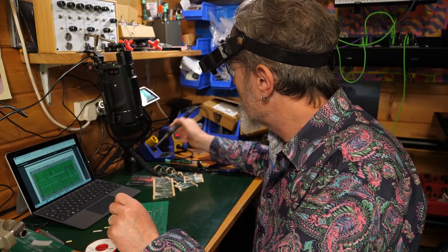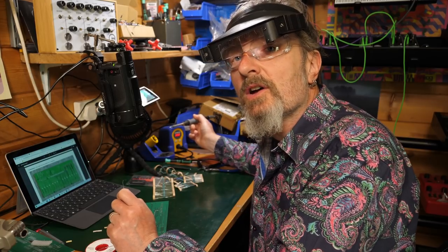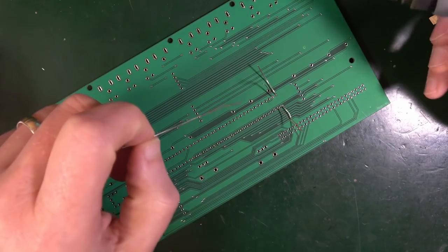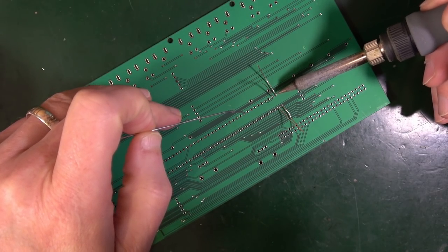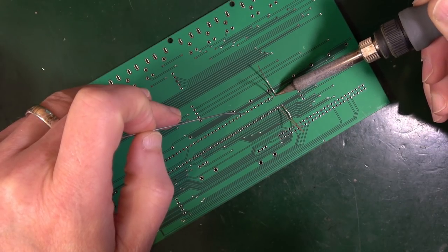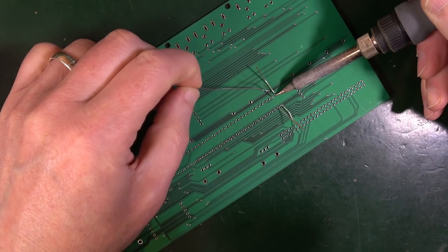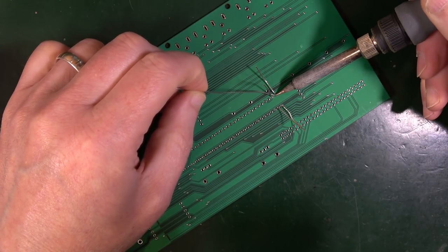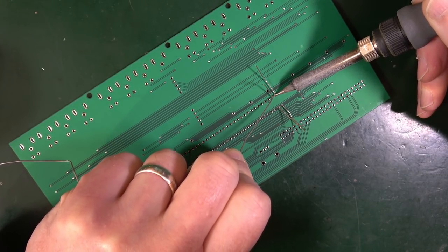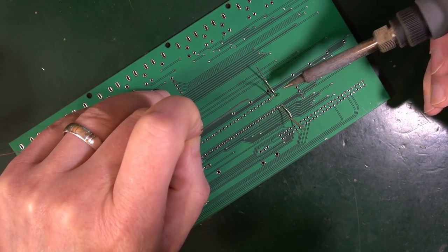So I use this wire wool to clean the end of my soldering iron. I also use a little bit of wet sponge. A combination of those two things seems to work. There's probably a reason for each. I can't quite remember. Anyway, what you want is your soldering iron to heat up both the ring and the leg. Now you find the very tip of the soldering iron isn't always necessarily the hottest place, but you have to get it in there wherever you can, where you're making best connection with everything. Then present your solder to it, and with a bit of luck, it will just melt gloriously. It may not, in which case you might need to angle it slightly differently, or perhaps even make contact with the soldering iron. But you just stuff some in there, leave the soldering iron on for a split second, and then remove.